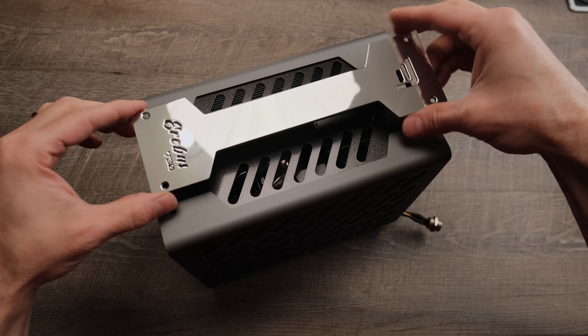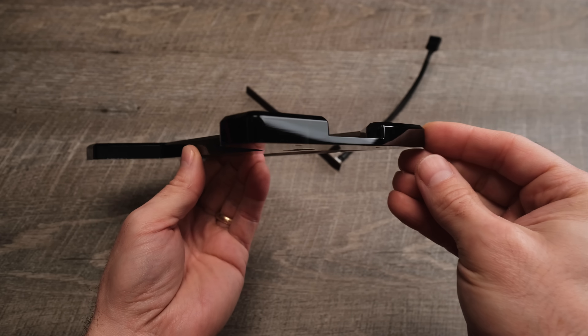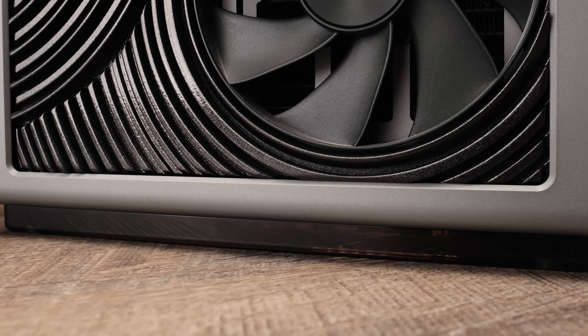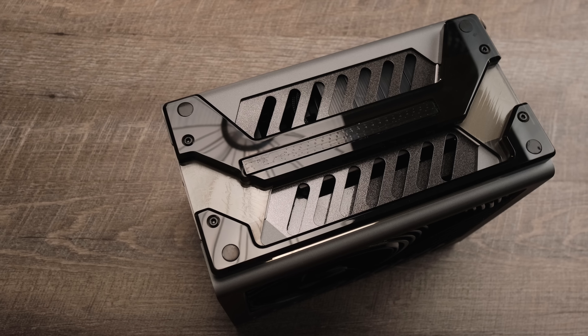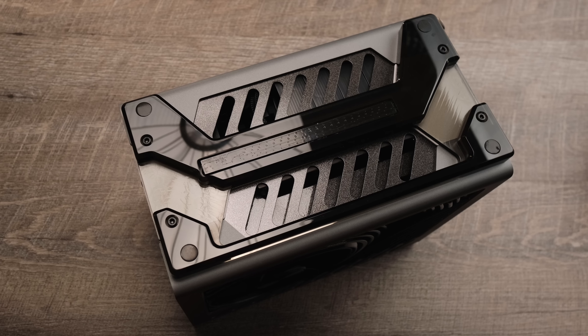A polished aluminum Skylink with the project logos crowns the build, which sits upon a 12mm thick polished dark smoke acrylic vertical stand. The vertical stand has isolated channel cutouts that allow cold air intake on the GPU side and hot air exhaust on the motherboard side.